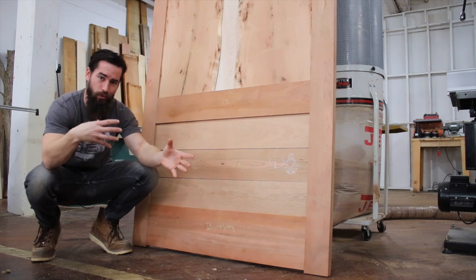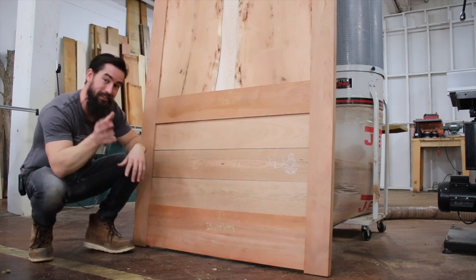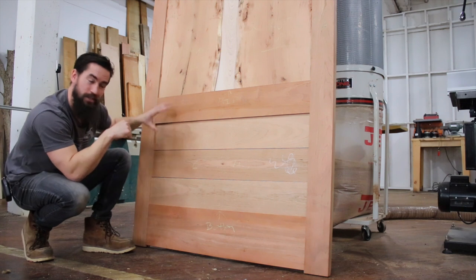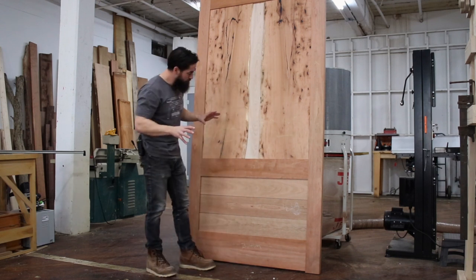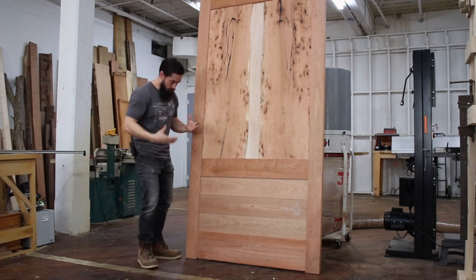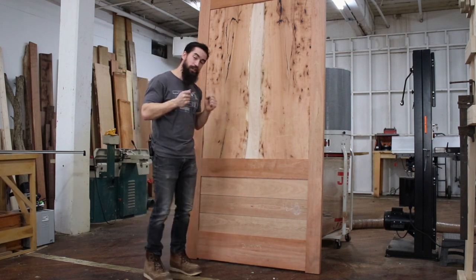How do you actually integrate this into a real project? I'm making a large door — four feet wide and 90 inches tall — so when it's glued up and hung, there is a ton of leverage on these joints. What I've done is use the small dominoes. I don't have an XL domino and I don't think you need one for this application. In this door I've got eight dominoes down below, six in the middle, and four up top on both sides — a total of 36 dominoes.